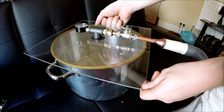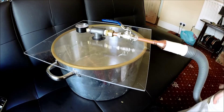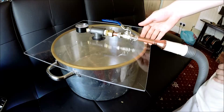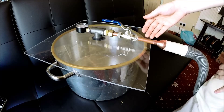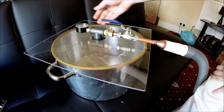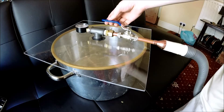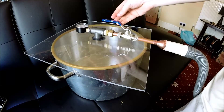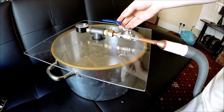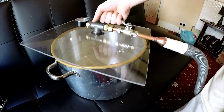The top is just a 5mm bit of Perspex — that was an eBay job. As for the pipework on top, there's no point in going into a huge amount of detail because you can put almost anything you want. You don't need the gauge, but it's useful to tell you how much vacuum you have and whether there are any leaks. Same with the valve — you don't have to have it; you can just run your vacuum pump for the amount of time you need to degas the silicone. But it's useful to have, and this one doubles up as a handle anyway.